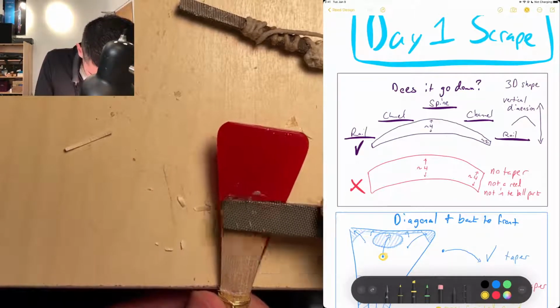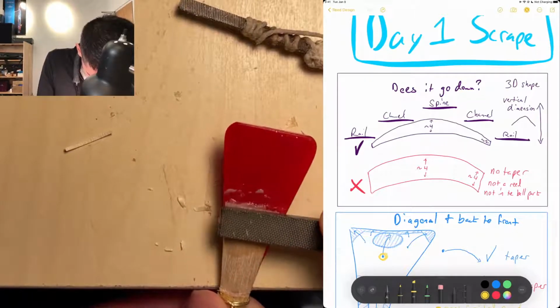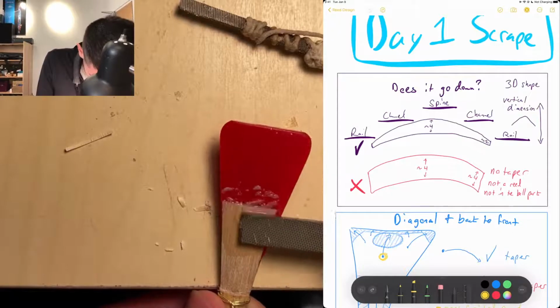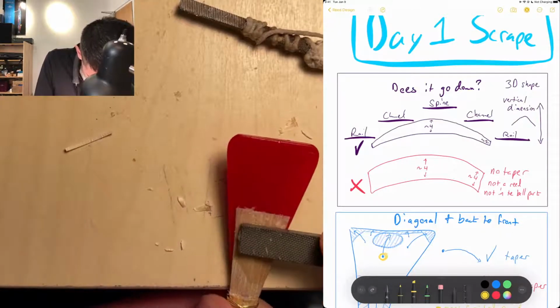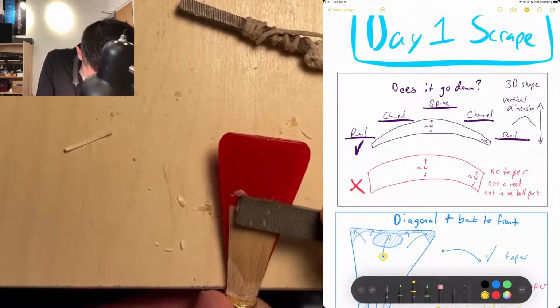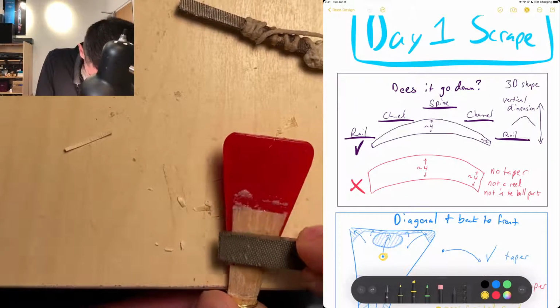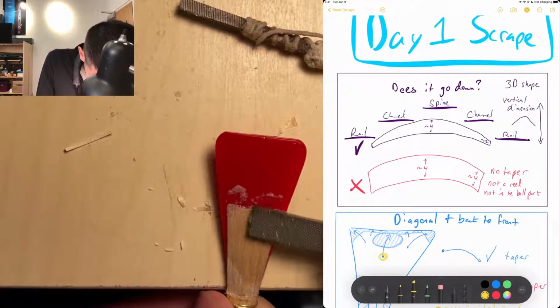the way it played suggested this point was too thick and the dial confirmed it, now we're scraping there based on what our eyes see. So again, that's the critical part. Only scrape if your eyes tell you, yes, that doesn't taper. Or yes, the taper could be better. Or more steep, or something like that. Eyes are always the final arbiter.